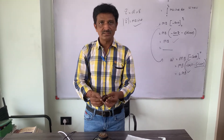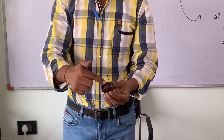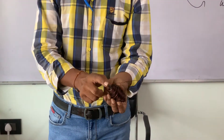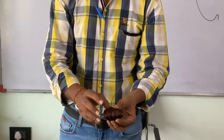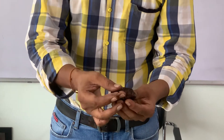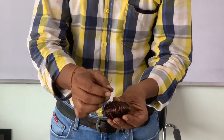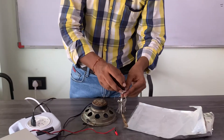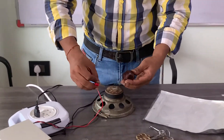Demonstrating an electromagnet. This one is a solenoid with a soft iron core. This one is winding wire with chemical insulation — round about 100 turns of thick copper wire. This type is not magnetic by itself, but if you pass current, a magnetic field is generated.